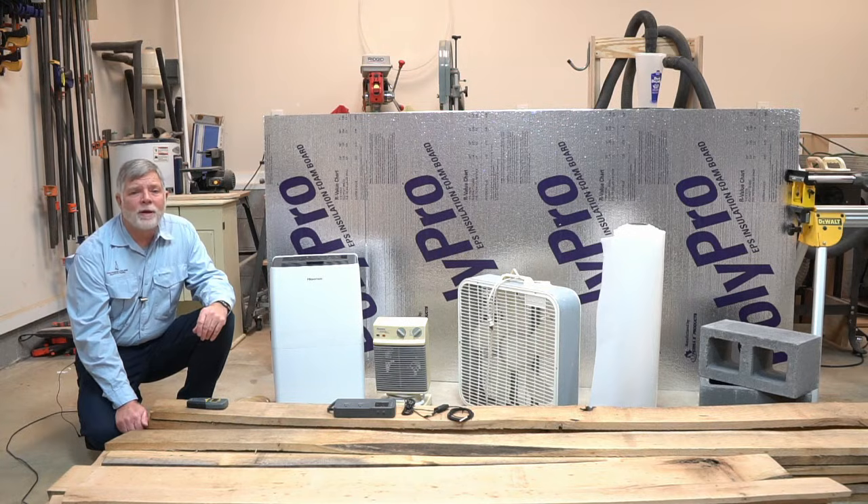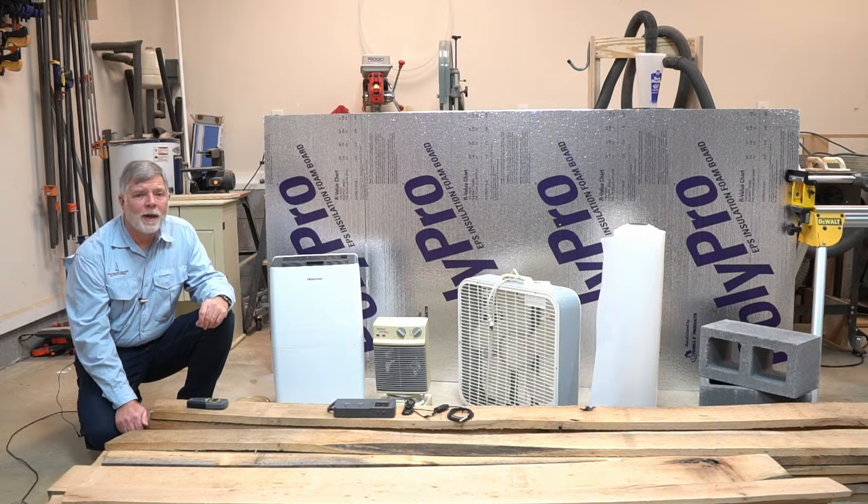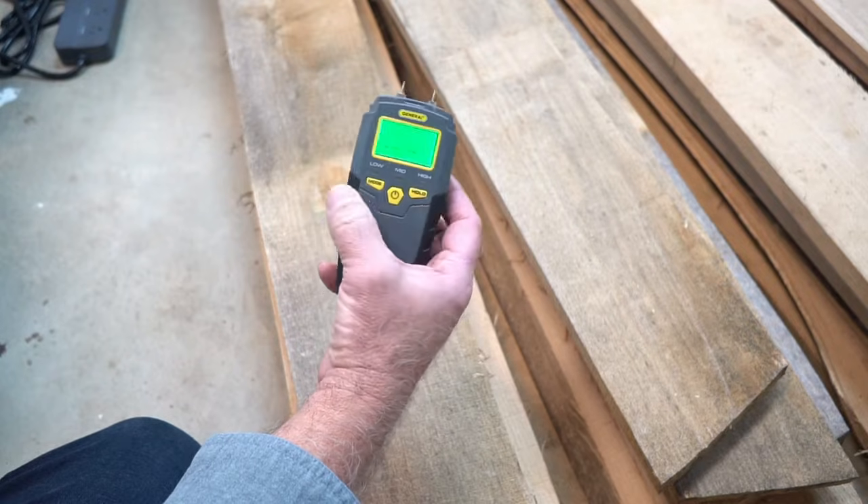This kiln design is intended to dry a small quantity of wood. The kiln performs two functions: it dries the lumber to its final moisture content, and it sterilizes the wood to kill any insects that may remain. This oak lumber has been air drying outside in my drying shed for about a year. The moisture content of this wood is approximately 12%, and I'm ready to make a table from this lumber.